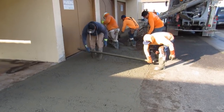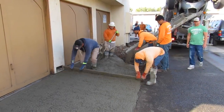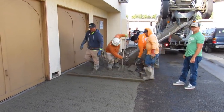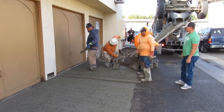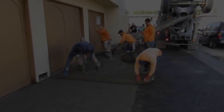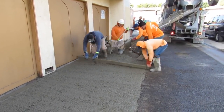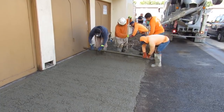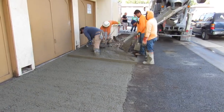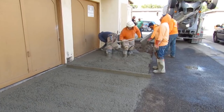Anybody can rod piss-wet concrete that self-levels, but in California you'll get thrown off the job. They crush-test most of the concrete — inspectors won't let you put a gallon of water in it even if you're pumping. I've seen them throw thermometers on it; if it hits 98–99 degrees they'll reject the load. When I pump at Disneyland and other jobs, they're pretty stringent — probably because of the earthquakes and different codes.